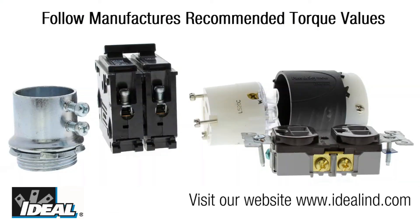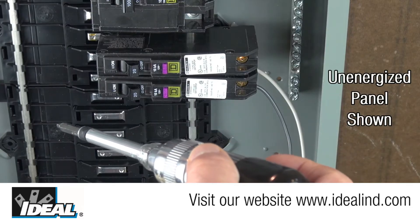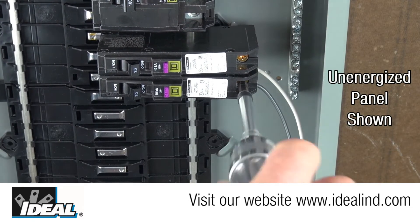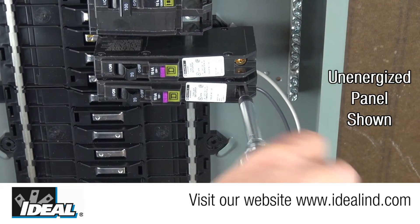Today you can find those recommendations on many electrical devices including receptacles, switches, and even EMT fittings. If the area you are living in is complying with the latest 2017 National Electric Code, it has added an additional article that requires the installer to use a calibrated torque tool to make these connections. Torquing the connection ensures a sound electrical and mechanical connection that is not done by how the installer feels the tightness of the connection.